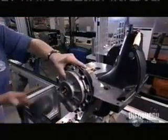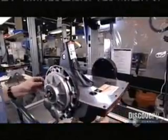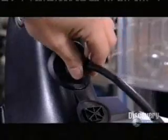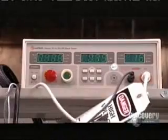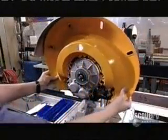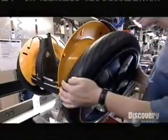The worker tightly secures the gearboxes to the chassis with a mallet. Then she opens a waterproof rubber seal and plugs in the machine's power cord. She tests the electrical system to ensure that it's grounded and that there's no short circuit. Next, she uses five screws to attach one of two plastic fenders. A tapered metal hub connects each wheel to its gearbox. The wheels are about the height of a small bicycle tire, but three times wider.